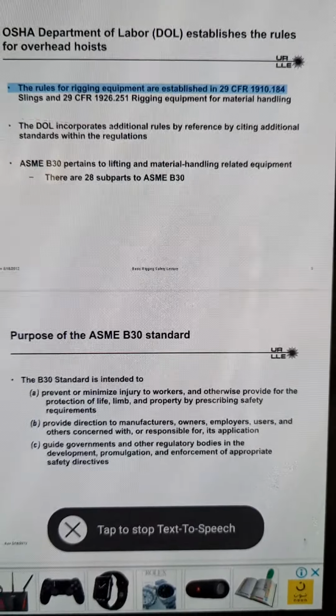Rev. May 18, 2012, Basic Rigging Safety, Lecture 42. All machinery eye bolts are not created equal. A comparison of the same size WLL shouldered eye bolts from Wire Rope, King, Chicago and Crosby manufacturers shows different ratings.